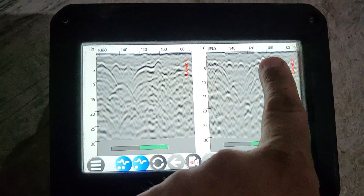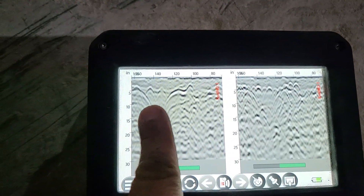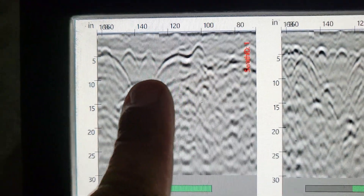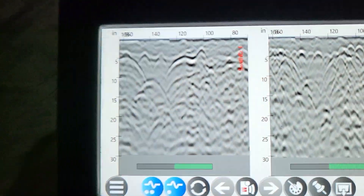In this case over here, you can see it dips down because there's a thickening of the concrete. This is cross-polarized, so you can see that here. I'm sorry about the noise — work's still going on — but you can see the beam, and then you can actually see the thick rebar inside the beam.